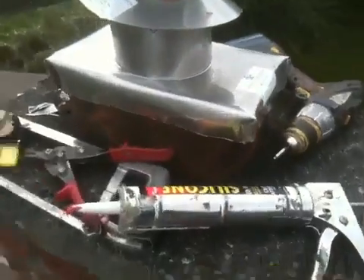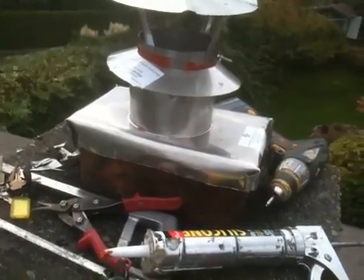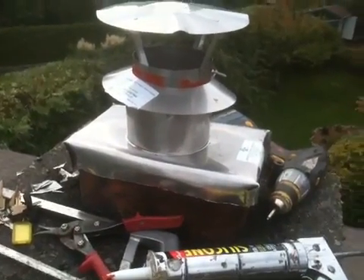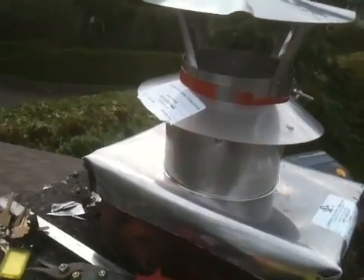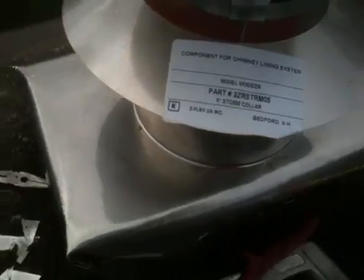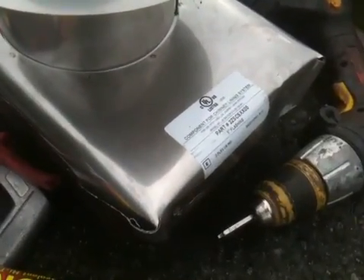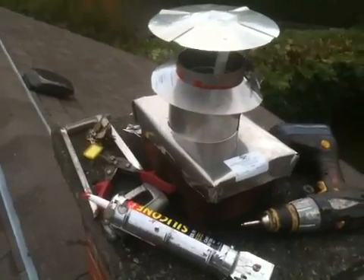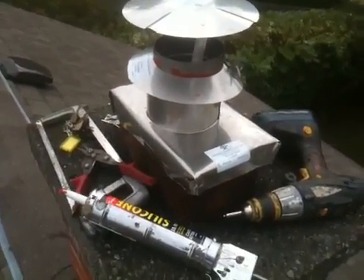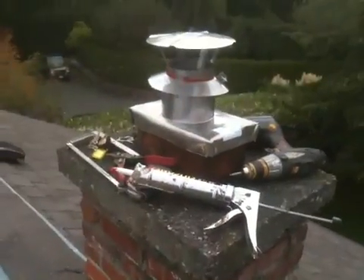Here we are back on the roof. We've got that liner down inside now — we had to pull on it a little bit from the bottom rope. We've made this flashing work over the existing clay flue, then we put the chimney cap and the storm collar on. You'll see labels on all these things — Canada and U.S. listed, it says Underwriters Laboratories — and it's all part of the same system, Zedflex. All of these have the same number on them, because they've all been tested under the same conditions, including the heat of the fire, and all these components perform together quite well.